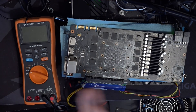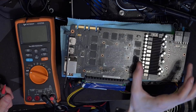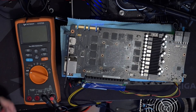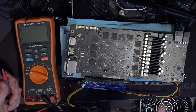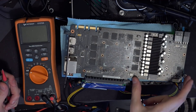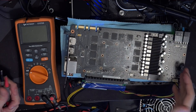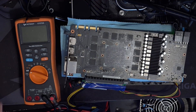One of the uses I have for dead GPUs is building e-powers out of them — basically stealing the VRM off of a card and using it to power another card, a motherboard, or whatever. You can get a really high current, low voltage power supply by cutting that part off the card. But the annoying thing is when you cut the card, the VRM portion stops working, because it typically requires all the circuitry on the other side. It doesn't just run off of the 8-pin and the 6-pin.